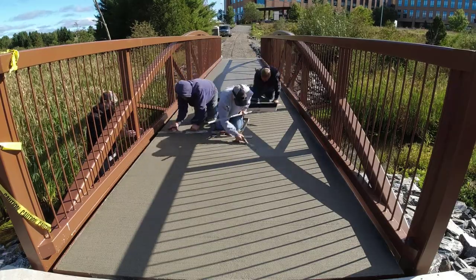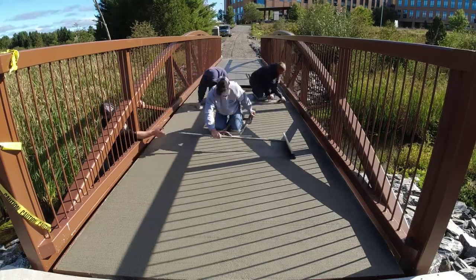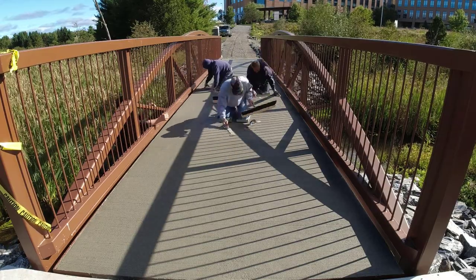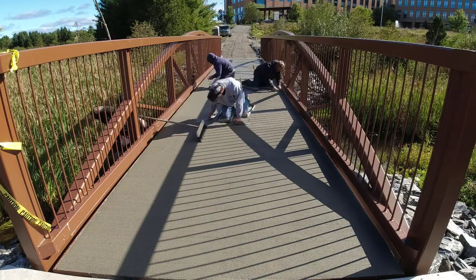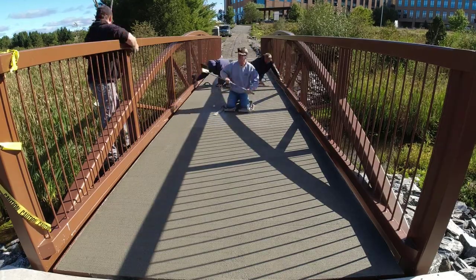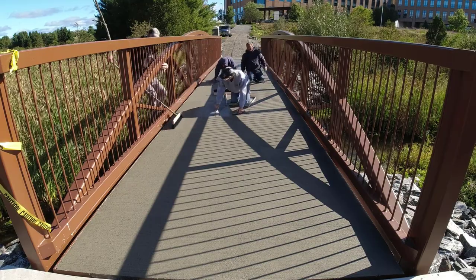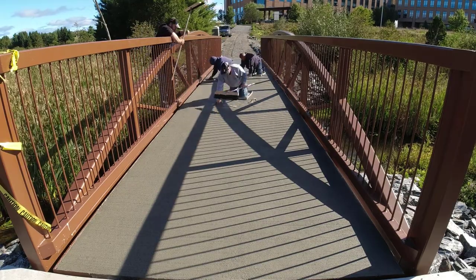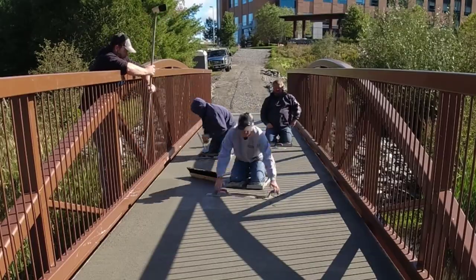This isn't like a huge project, 53x8. But it's cold, it's kind of chilly out, it's dry, it's windy, so that day one finishing aid really helped a lot too. As we mag the surface out here, it is a little dry, but it's not ripping and tearing like it normally would on a windy day, so that's working out good too.